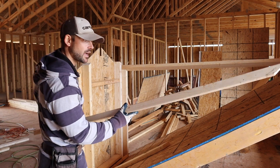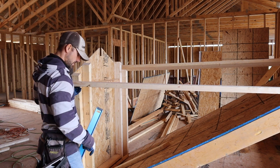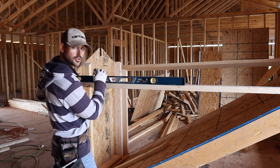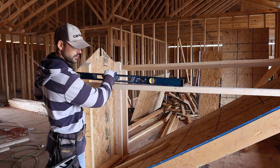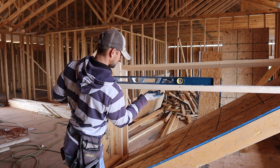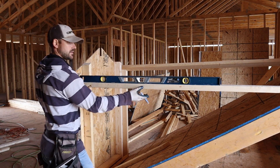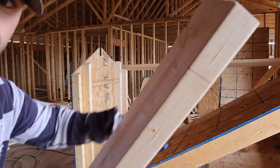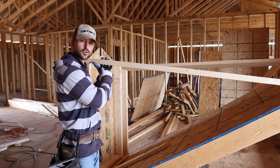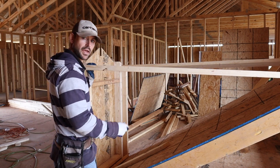Now we've got our bevel and our mark for where the top of the wall is going to be. Put the top plate on the roof, try to line it up with your mark, and put your level on top. The trick is to slide it up and down the roof until your level is level with the mark you made for the top of your wall. Once you get it there, scribe the back of the board to be cut to that length — that gives you a level top plate from that mark to where it intersects the roof. Then put a two-foot on-center layout starting from the face side of the dormer going across the bottom half of the top plate.